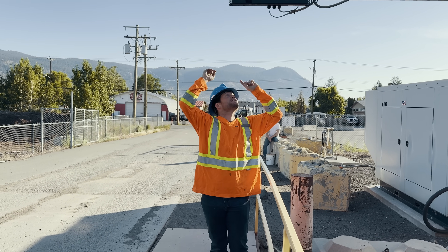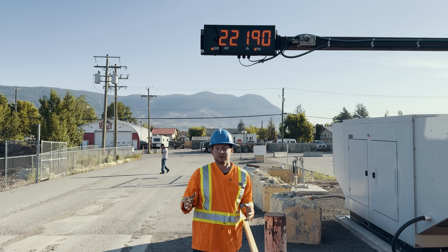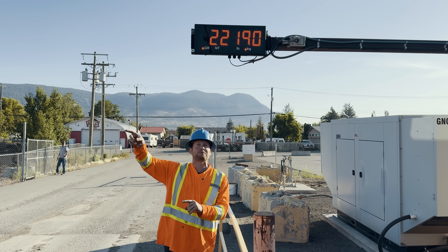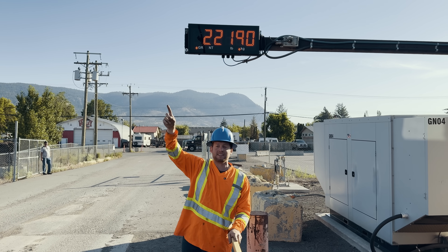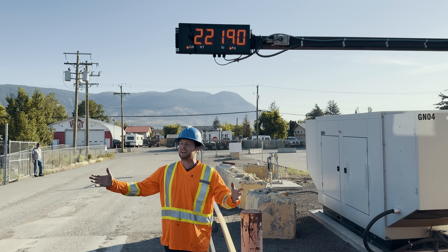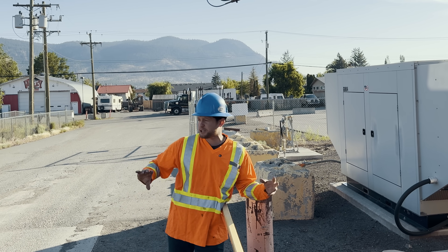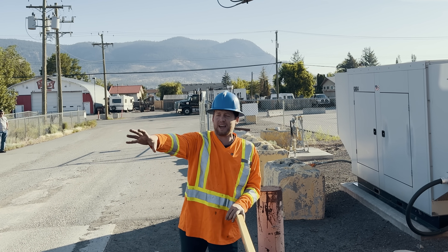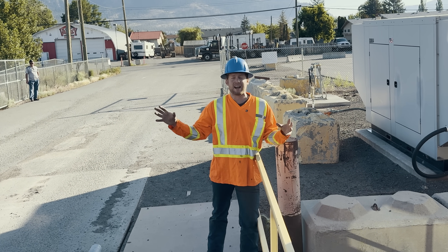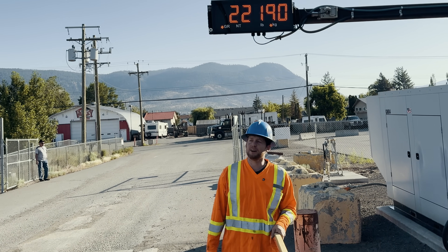This is the same rig-out that me and Theron had on both of our logging trucks, which means we are the same weight as a conventional truck. And we know we can lose like another thousand pounds — we can get this down to 21 — which means the hybrid system is still lighter, but you get the extra 1,500. So we can pull more payload than a normal truck. The math works. And this is a long wheelbase, so extra frame rail, extra steel on the hood, a heavier cab than needed, and more batteries than the production truck is going to have — it's got like two more batteries than the production truck. So this thing is going to be the payload king of the bush.